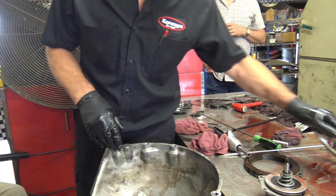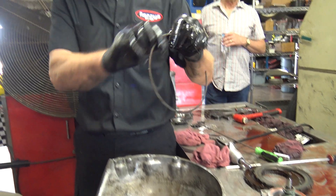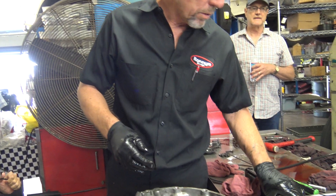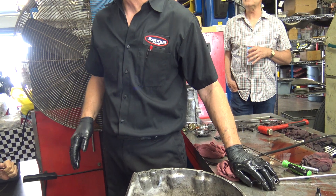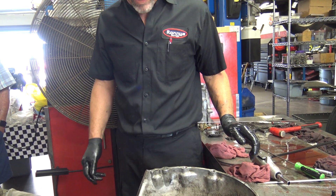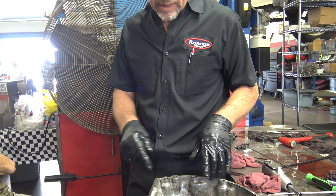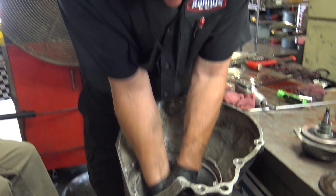For those of you watching, pay close attention. This top one is less stout but it's rectangular — it has no chamfer on it. I'm not sure why, unless it's just taking up a little tension, holding the piston assembly against the center support. The other one holds the other end of the clutches, so it's getting hammered there — and it's going against some pretty stout housing already.